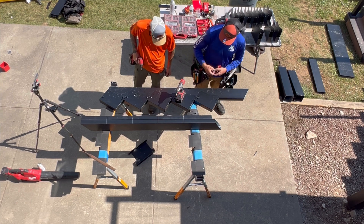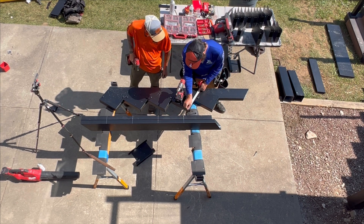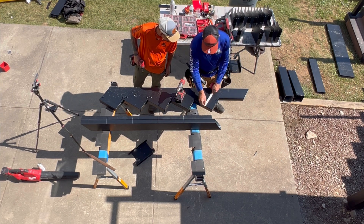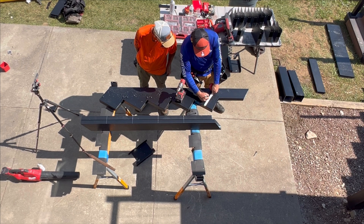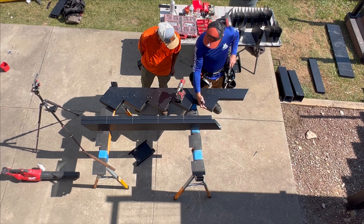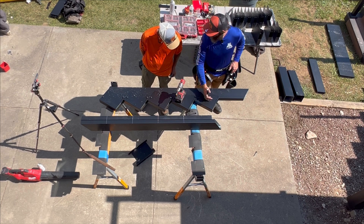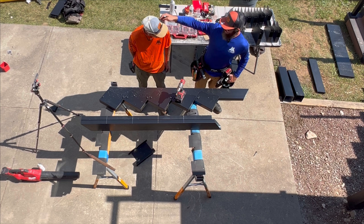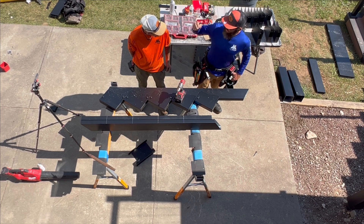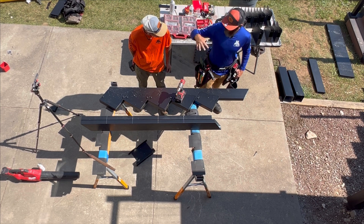This is the one you've got to leave out — we usually put a screw there. We'll take this pin out. Then we have our rise, which is 6 and 1/8. We'll take an inch off for decking on the bottom and mark 5 and 1/8. We take an inch off the bottom dimension so when you put your decking on top you have the same size stair run.